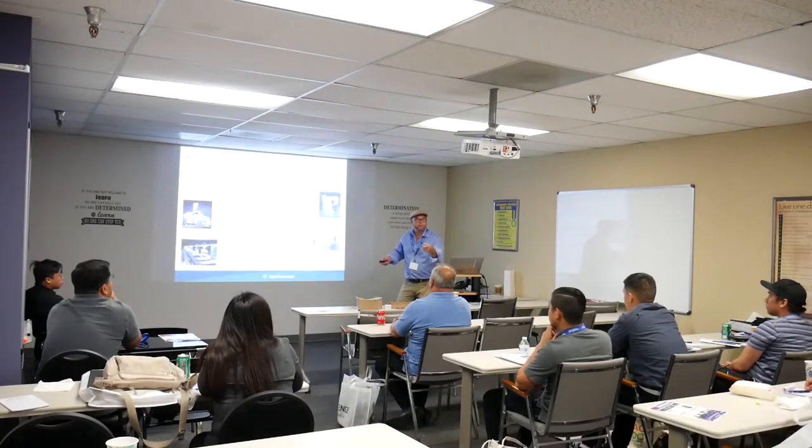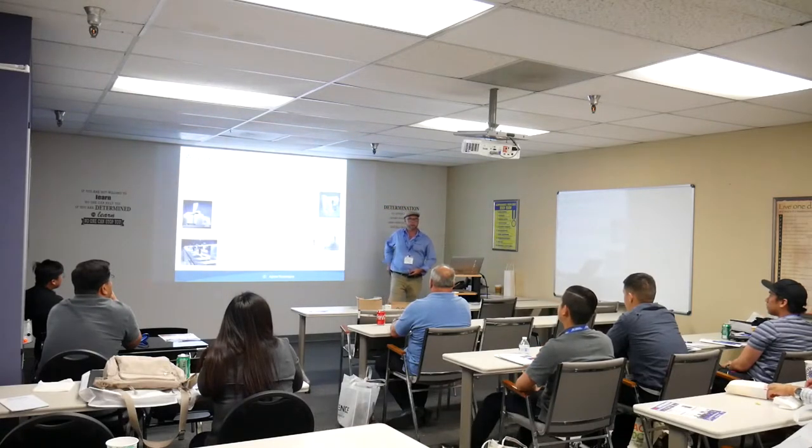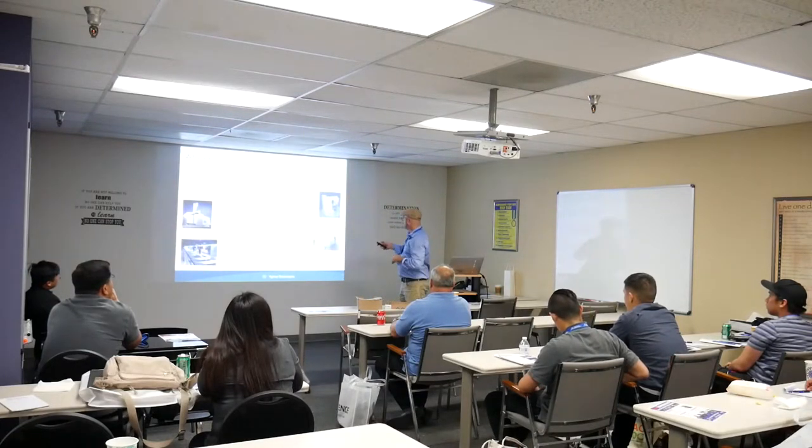How big is my leak? Where is it? How much product am I losing? In semiconductor — everything in your iPhone — we're down to an angstrom level of deposition. The only way to achieve angstrom-level deposition is to remove everything we're breathing. All the stuff we're breathing is contaminant — remove it, then reintroduce chemistry for 100% deposition at the angstrom level.